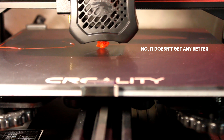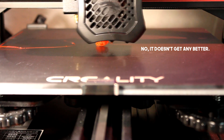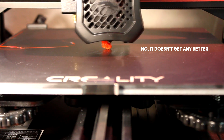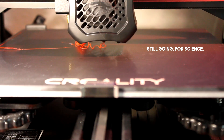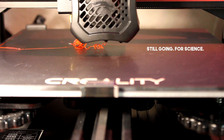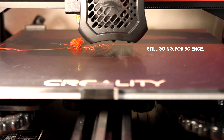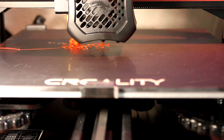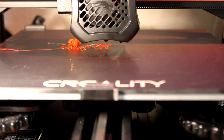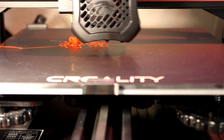Now all this advice — don't get me wrong — it's all well intentioned and quite a few if not all of these suggestions will work. I use masking tape or glue stick on my plain glass plates on other printers like the mini delta here. But the advice for me is somewhat missing the point — the Creality bed is amazing and is what you either directly or indirectly bought. I imagine a lot of development time went into creating this coating, and in my opinion it is vastly superior. Things stick to it with incredible force while it's hot and they come off immediately without any force when it's cool. That's the point of the coating. But of course if that's not happening, I can fully understand the frustration and how you might want to jump to a method you've used in the past rather than spend time fighting the bed.